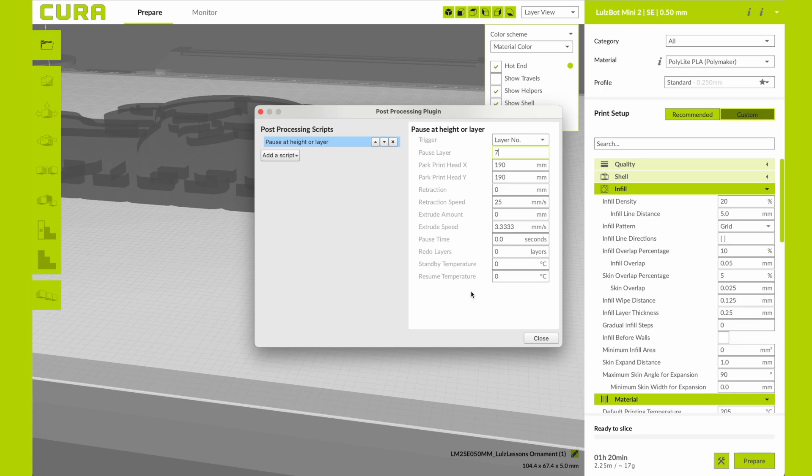By default it's going to actually cool down, so if this pauses overnight, it'll cool down and you can heat up the nozzle when you do your filament change. Or you can set the standby at a certain temperature like 200 degrees if you just want to run right into your filament change — that's kind of up to you. By default, everything's set to zero and it just hangs out and waits for you to come back.